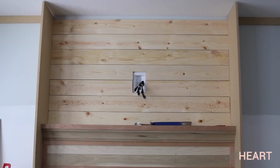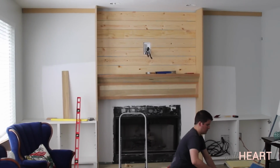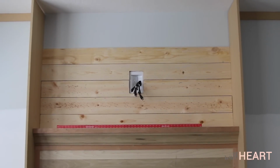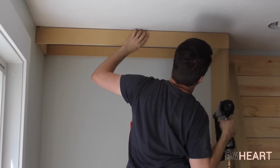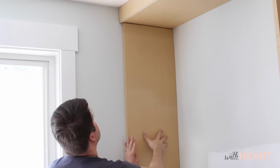Picking up where we left off, our project is halfway finished. The base cabinets are in place and the 3/4-inch side panels have been installed from floor to ceiling on either side of the fireplace mantle. We continued to build the built-in shelves by installing 3/4-inch panels from above the base cabinets to the ceiling and